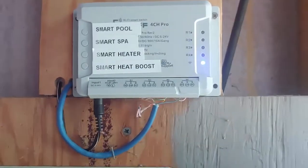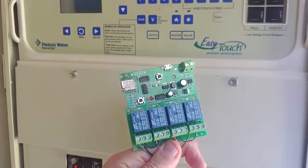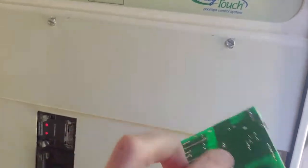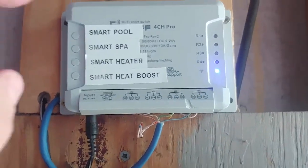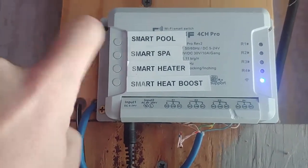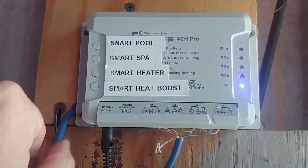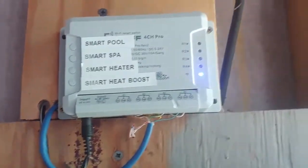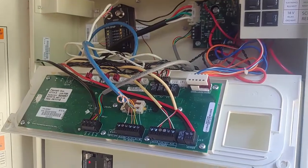This Sonoff is particularly cool because I upgraded from another board. It's in the video you may have already seen on YouTube that sort of told the world how to do this. Those can be had for $12 to $18 online — very similar to this, does the same thing, but doesn't come with a case or buttons. So you can get this Sonoff for $29 and it comes with buttons, giving you the ability to walk up and manually press a button to turn on your pool. It's a momentary switch — normally open, normally closed, just touching for a second.